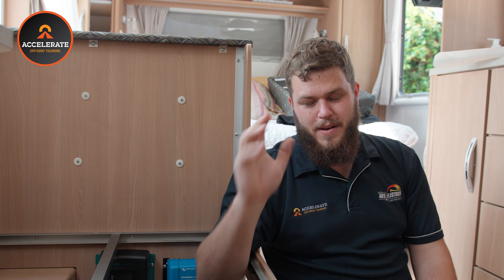The main reason we've gone with this one for this customer is that even though he's got a massive amount of solar and massive battery storage, he wanted the ability — if they had a week of bad weather — to just chuck a generator on and really cram the charging in quickly. Being there's a 100 amp charger and 600 amp hours of lithium, it's six hours running the genny from dead empty to dead full and it's got a full van again.